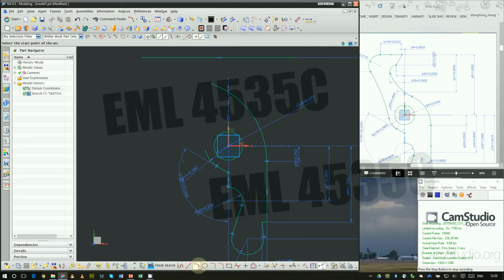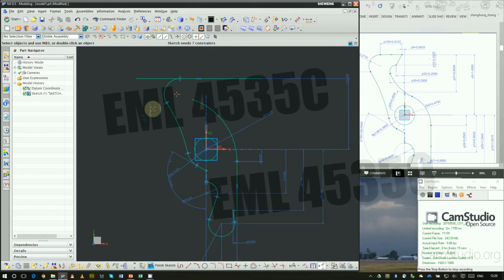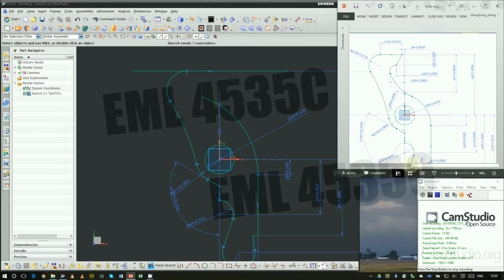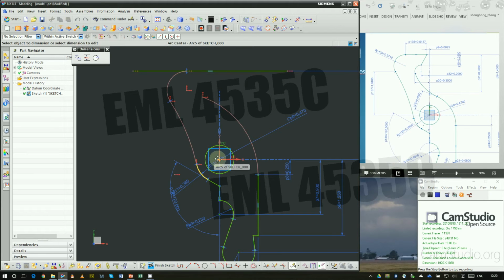Okay. So on the left side, we have one arc that looks like this, tangent. Then another arc actually connects to the top, then be tangent. So this side is also tangent between these two arcs, right? Something like this. And we can try to put dimensions there from the origin or x-axis to this point, 1.0408. Okay, then we have a radius here, which is 0.2710.